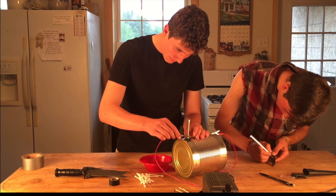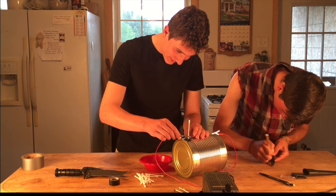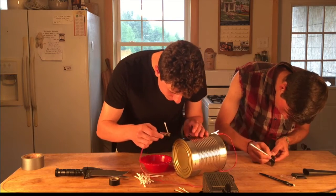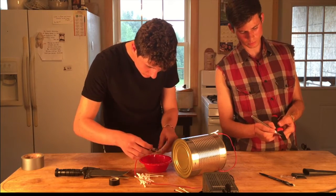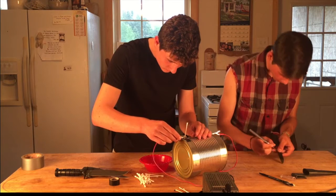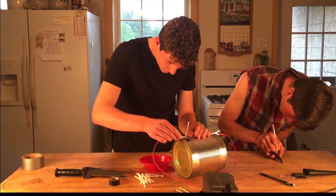You want to be careful when you're cutting the design — you don't want to cut yourself. You definitely want to be careful not to disturb the tape around where you're cutting out your design, because you want it to stick solid so it doesn't let any salt water underneath; otherwise it's going to etch wherever it touches the metal.